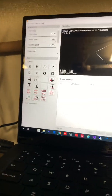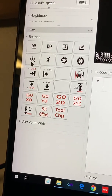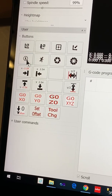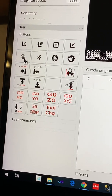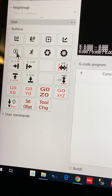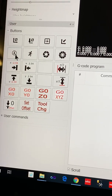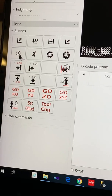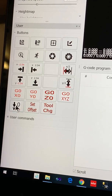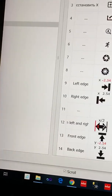We have a cable going back to the controller for the Z-axis. We have this button here to find the zero on the Z-axis. Once it finds the zero position, it goes to the location of the switch and probes that switch as well to get the offset. When we change the tool, we use this other button to go to the switch and get the offset from that location. Now let's look at the actual code.